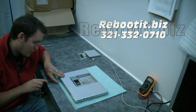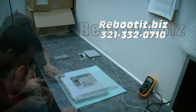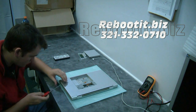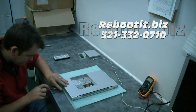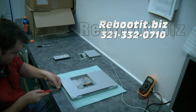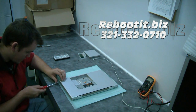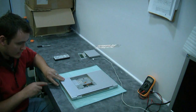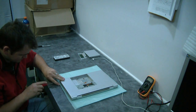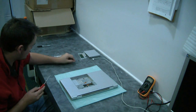I'm going to need that little star head screwdriver. Any words of wisdom to keep these running nice and cool for the long term? Clean them out. Good can of compressed air or an air compressor if you've got one, and just spray it out from the back side right behind the screen.